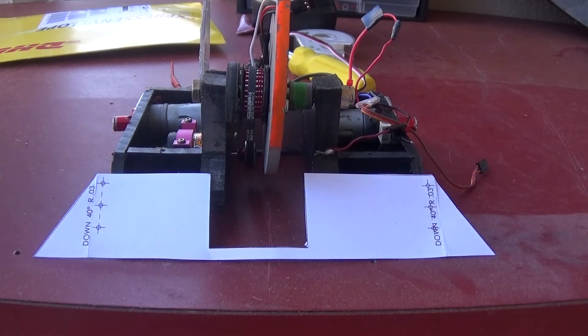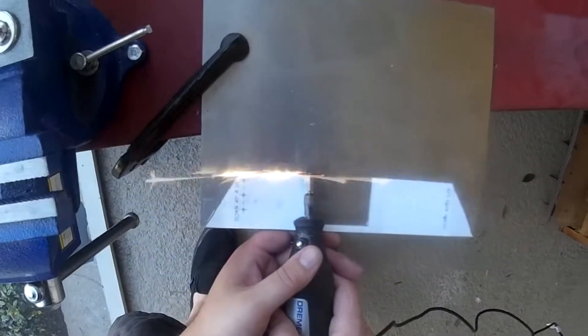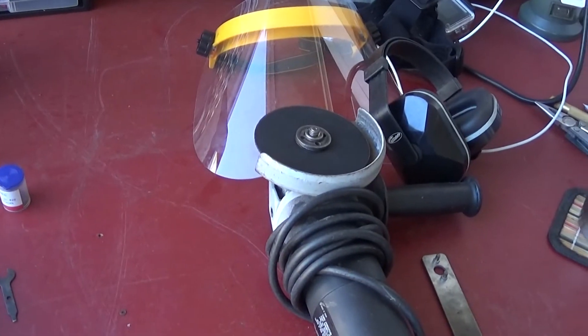I've made two patterns of this. I'm going to make it out of 1mm titanium first, but then I'm going to cover it up with some .09 inch Lexan - that's just going to combine the two materials. I've done it before with Demon Spawn's front wedge, so I kind of add the Lexan to absorb some impact and the titanium just to be a strong backing to it. I kind of like it for the fact that it doesn't give off sparks, so it's a little less obvious that you have damage being done to you. Grinding wheels on a Dremel are pretty useless against titanium - they just take forever and get worn down exceptionally fast, so it's time to step things up.